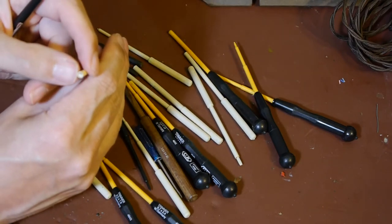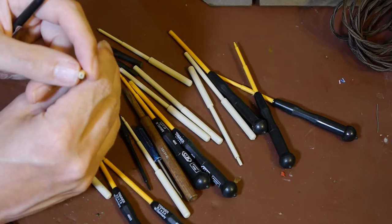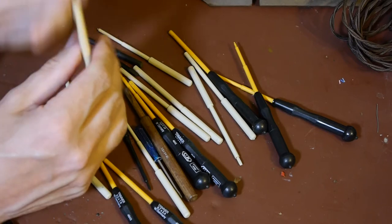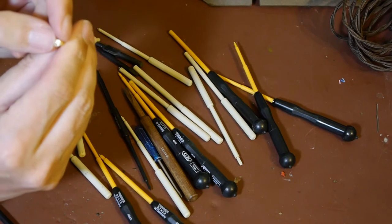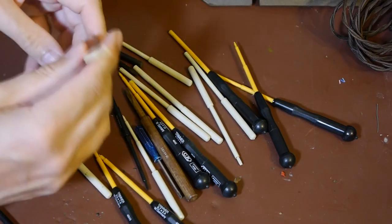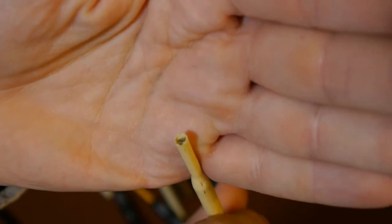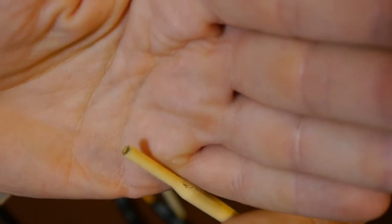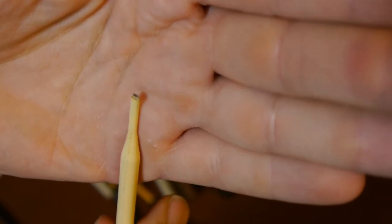You've got a little brass blade at one end and a brass blade at the other, but this one is actually inset with a ring around it. The purpose of that ring is when you're using this trimming tool on a micro potentiometer, you keep slipping off it, so the guide ring limits movement and makes sure you can't slip off the head of the screw. There's a little strip of brass surrounded by a ring of plastic - it just stops the blade from slipping out of the screw head.